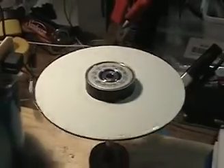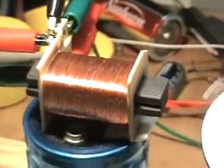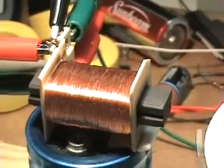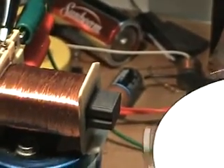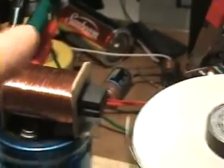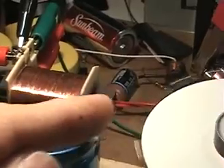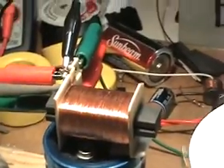There's the platter of a disc drive that has the four magnets, and this is the new coil I'm using. In my first video — the gobo test one — the little coil I was using had a magnet incorporated in it. I broke it apart and got the magnet out, but that magnet was working against the other field. The small magnet inside that core was actually the same pole as my magnets here, so the thing wasn't working very efficiently.